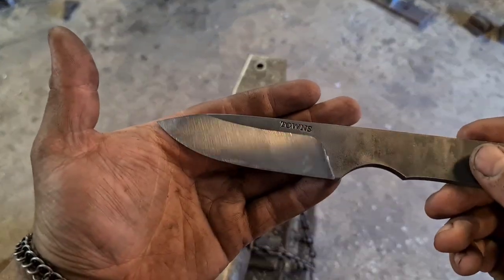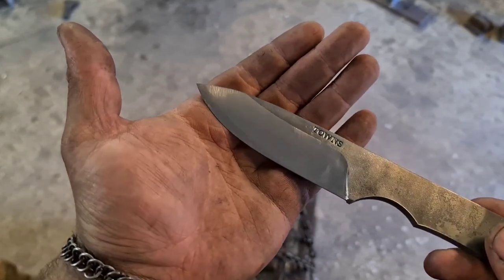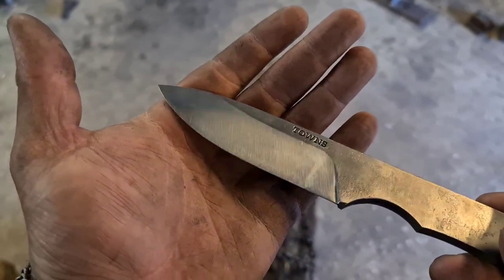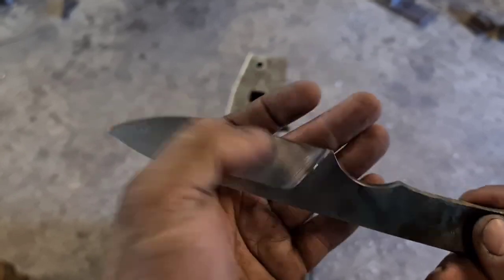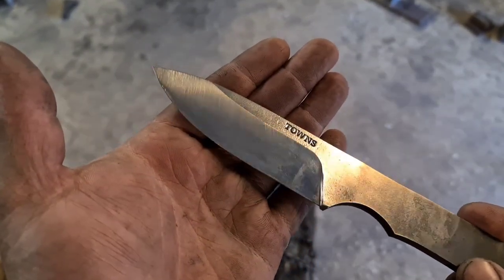And you can take that, obviously, up to 1200 grit off the grinder if you really want to. I probably need to take it back to the grinder just to get rid of those little 240 grit scratches, and I think this side I have a couple too, right here. But, yeah, hopefully that helps some people on how to make Sabre grinds.